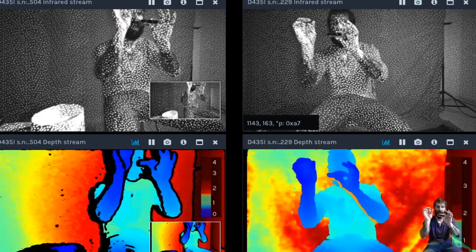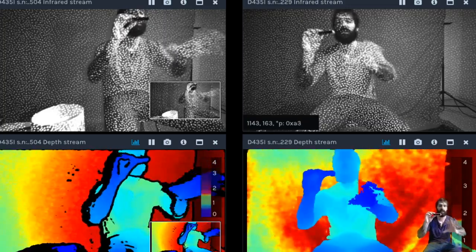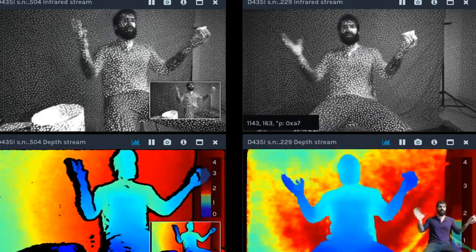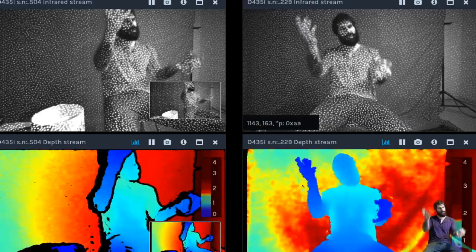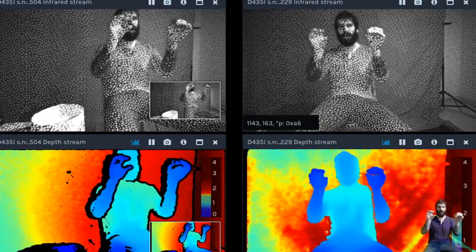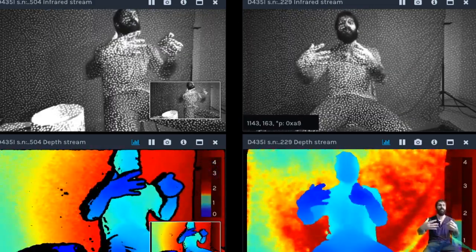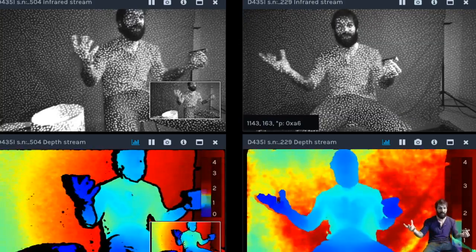The VCSEL system is very small — only about 2.7 millimeters by 1.8 millimeters — and it can record up to 60 frames per second. OmniVision supplies the three image sensors: a CMOS 1080p RGB sensor and twin one-megapixel sensors for the left and right side imagers. The resolution on this is incredible compared to other sensors. I have both depth streams set up with different parameters — one for accuracy, one for density — with additional filtration and hole-gap algorithms on each side. In the next video series, we're going to stream three of these together and combine all that information to generate a highly accurate 3D volumetric capture that we can output to the Magic Leap.